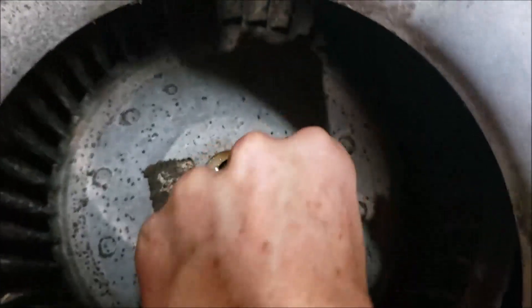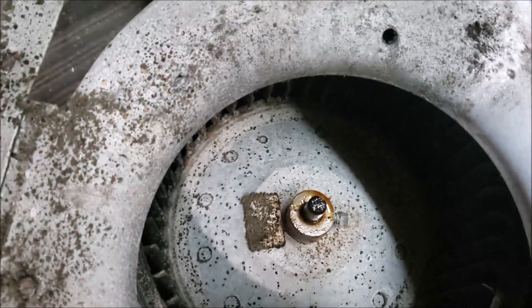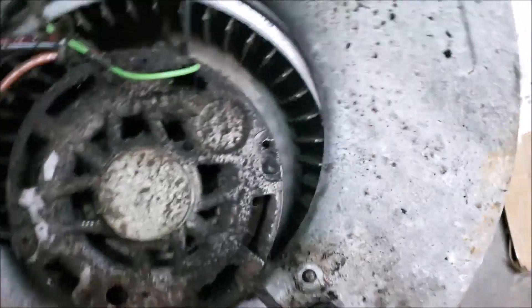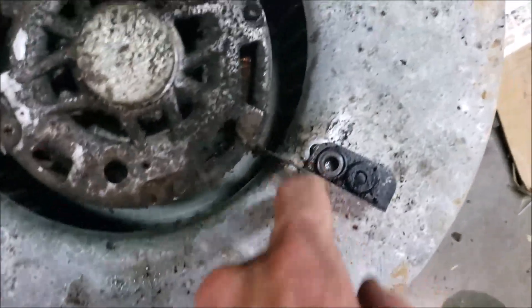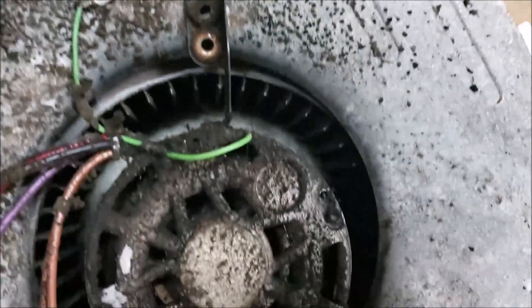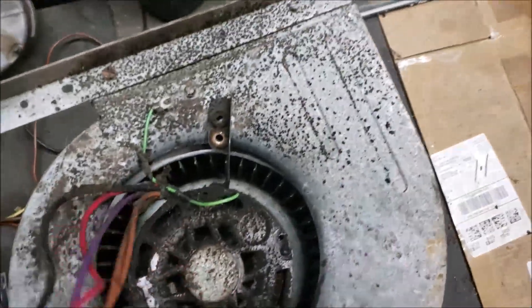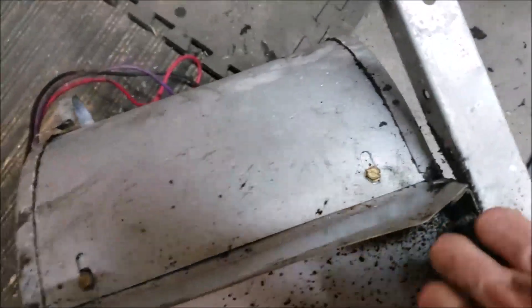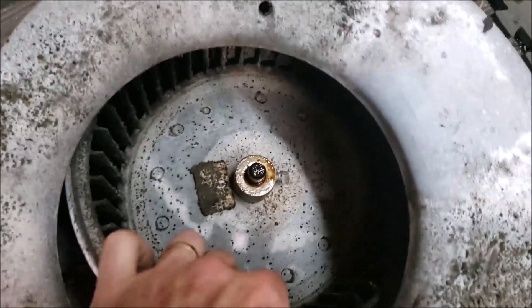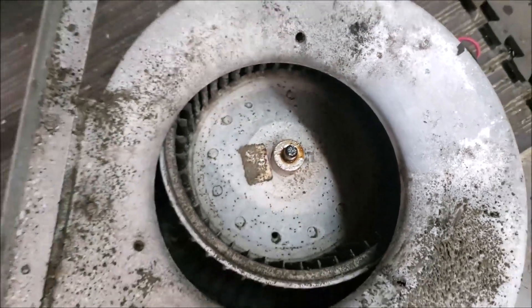Before I can change this thing, I've got this screw loosened here. I cleaned the rust off that shaft and I'm working it back and forth — going to try to get that motor off. I've got the three little brackets and I've got these screws out here. Of course two of them broke off, so I get to tap those out and deal with that too. I've got everything else loose and I'll try to get this motor out of here. I'll kind of turn it upside down on a bucket, and if I can use the weight of the motor to pull on the shaft, I'll just try to tap it with a punch and a hammer to get that motor to drop free.